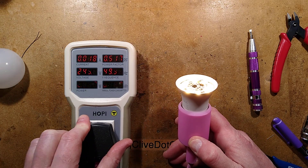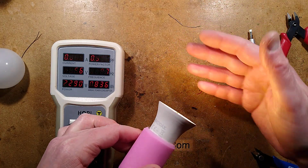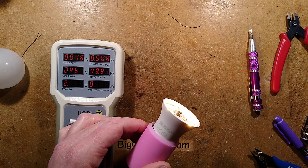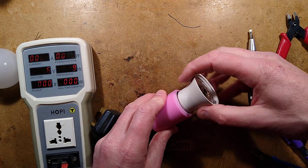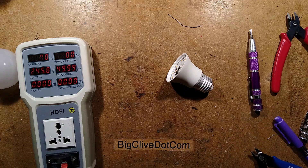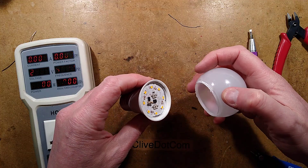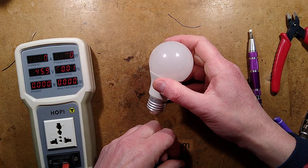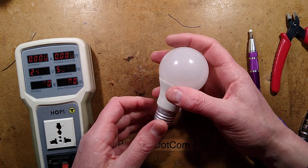2.3 watts — that's ideal. To be fair, with the 47 ohm resistor at half the power this was still fairly bright, competing with the studio lighting here — good for ornate caps. But adjusting the power and halving it will considerably extend the life of the lamp exponentially and improve its efficiency. Going even lower like this, the lamp goes from being a large area illumination lamp to more of a corridor or cupboard type lamp. But the lifespan will be massive now because it's running at a fraction of its original power.